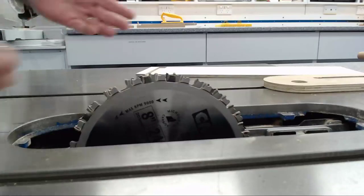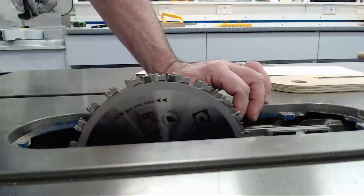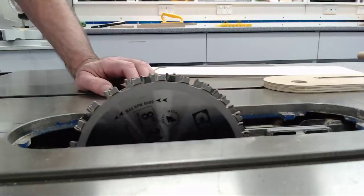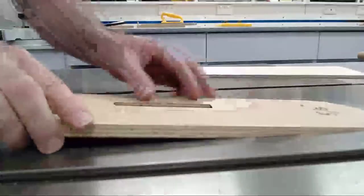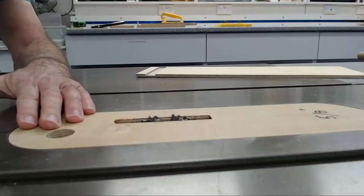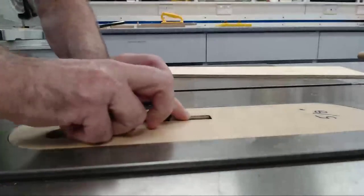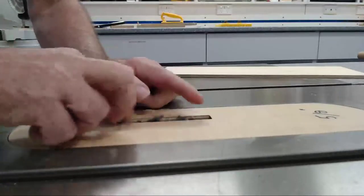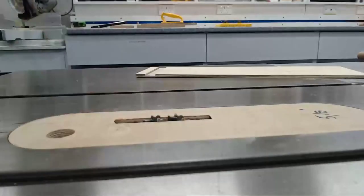Okay, all right. So I've got the stack back on. That was the thinnest blade. It has thin blades as well, like the Torquetta, on the chippers. I'm going to lower the stack down and put this in, which is the insert, of course. And bring the insert up to about there. Make sure it's going to pass through okay. Yes, and I can do that because I have disabled the machine over there. All right, let's put this back up there and we can watch it coming through.